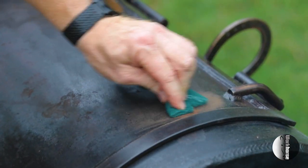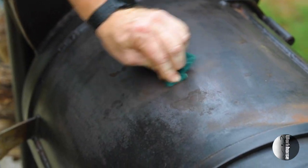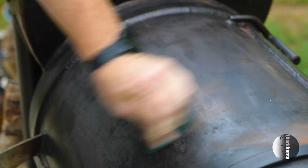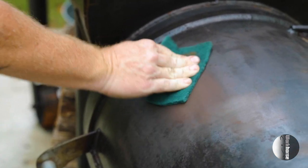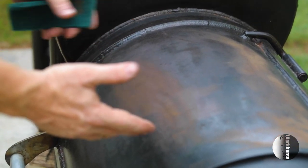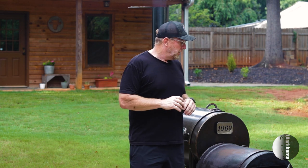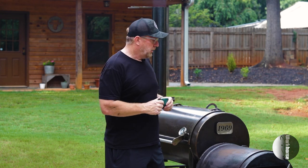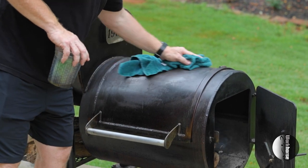Make sure you're not burning yourself, so you may want to double up your Scotch-Brite pad. I'm going to knock out the rust — just knock out where the moisture has sat and started the rusting process. This coating that I had on here has lasted about six to seven months. With a cover, you're going to be able to prevent rust from happening for maybe a year or longer. If you're uncovered you'll get it a little quicker, but don't worry — you can bring it right back to its full shine and shimmer like it's brand new.